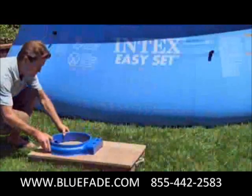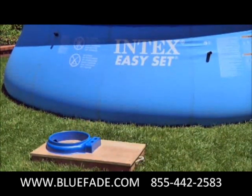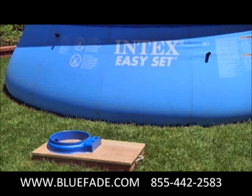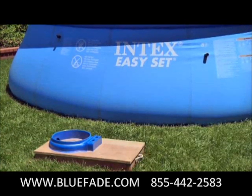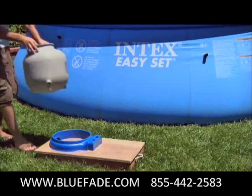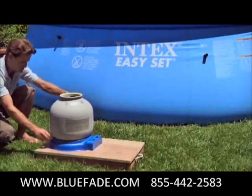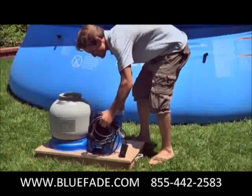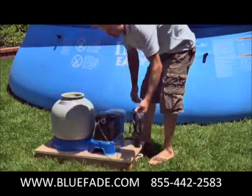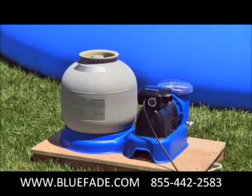Place the tank support base in the selected position. Some countries require that the product be secured to the ground or a base in a level, upright position. Check for local requirements. Place the tank on the base as shown. Connect the motor pre-filter assembly to the tank support base with the water inlet hose connection facing the pool.